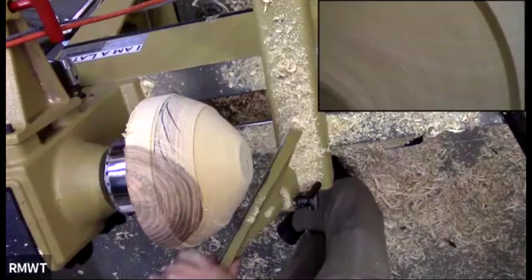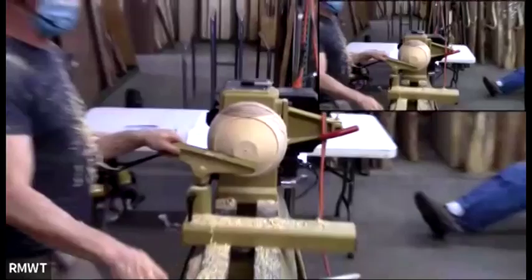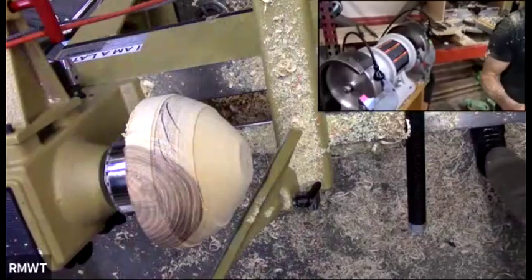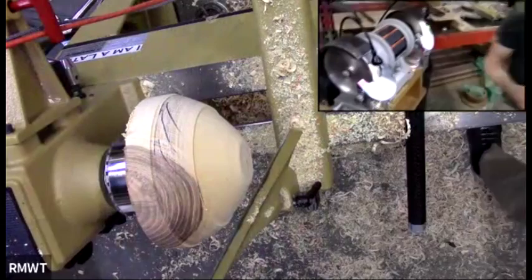There's also a bigger problem with scraping where you're pulling the nose around versus over rubbing the bevel. What's the bigger problem that I just created myself? Anybody realize what I did to the gouge? Dull, instantly. So now I go back and it won't give me a good finish. So how many times faster does it dull by scraping than it does by cutting? Anybody know the number? 30 times faster.